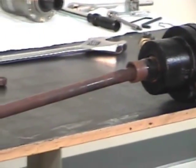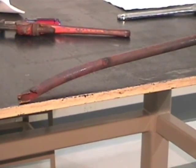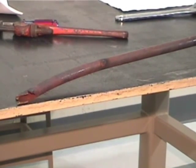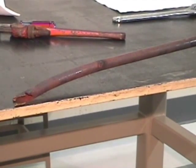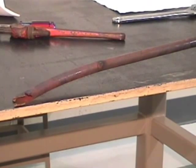This is the Johnson joint that has just been removed. The siphon bend should have come down about 5 inches. Obviously, this appears that the bend is not more than 3 inches. Therefore, there was a 2-inch level of condensate in the roll impacting heat transfer. We can correct the situation with proper measurement and proper bend to minimize the condensate level and maximize heat transfer.